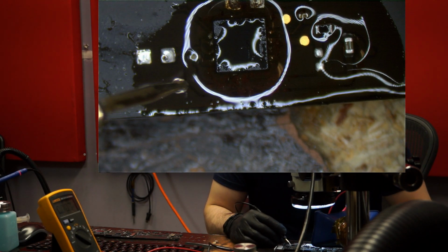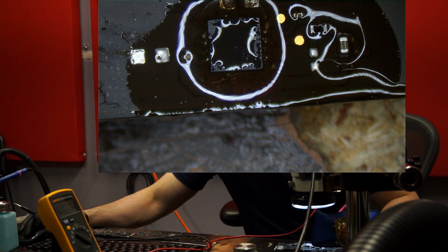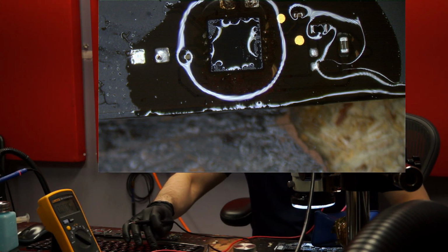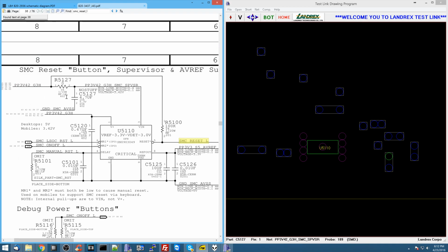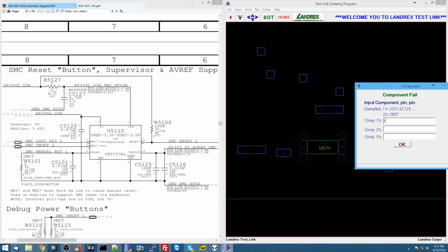Or R5100 is bad. Where is R5100? R5100 is a pull-up resistor. That's going to allow that signal to be where it is. So, let's show you what I mean by that. R5100 is going to pull up SMC reset L unless the SMC or this chip pull it down. So R5100 is sitting between 3.42 volts in here. So R5100...